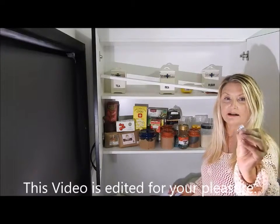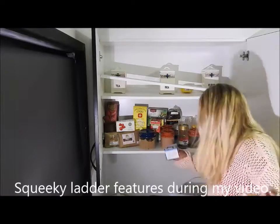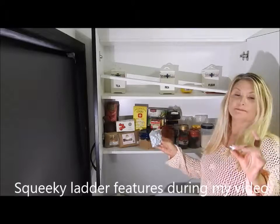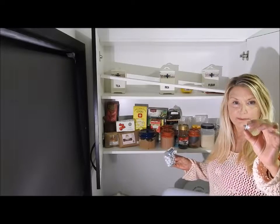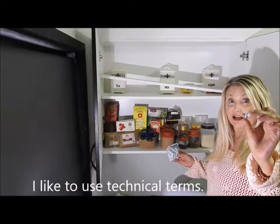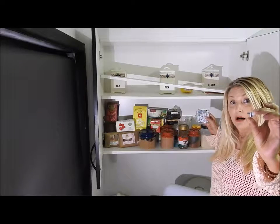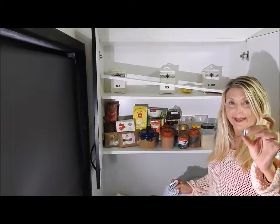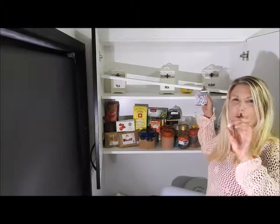These are the little shelf holder uppers. Oh, shelf supports. So you have to drill a hole into the side, but because this little bit is up and this little bit is down, just when you're marking in the side, put them a little bit lower than where you want them to be, because when you put the shelf on, that's going to make it higher, and then you'll have it at the wrong height, especially if you're trying to fit it in like I am in a small space, so you can just put glasses at the top.